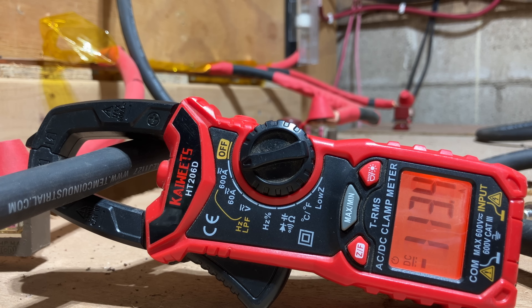According to the specs, they recommend 50 amps — that's 0.5C output — and it can do a full 100 amps, so a 1C output. We are going to push that to the extreme, well past 1C. We're going to go past 2C and probably up to 3C. We're going to push this battery hard to see what it can do.